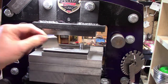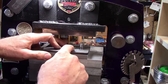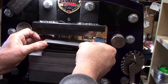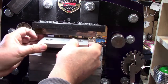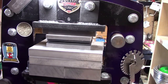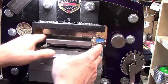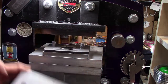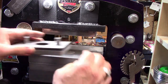This is, again, 20-gauge sterling. That was 20-gauge copper as well. And this will form the base for a small prong setting, I think, for when that piece is done. And that will match it perfectly. Okay, so put that in there and cut it. You notice the snick you hear when it cuts. That's because it's fresh out of the rolling mill, and the metal is quite hard, and that actually is what is best for using a punch or a die like this.